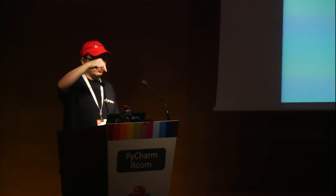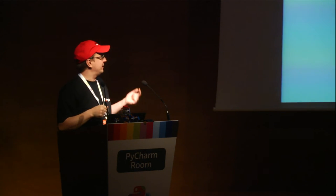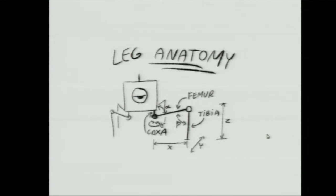If you want to place a leg at a precise point in three-dimensional space, you need at least three degrees of freedom on each leg. When you move the servos, you specify the angle to move them. When you want to move a leg somewhere, you specify coordinates. There is a way to calculate angles from coordinates — it's called inverse kinematics — and that's basically high school geometry. You solve all the triangles and calculate the angles to move your leg to the desired position.